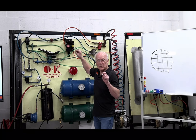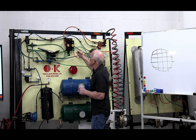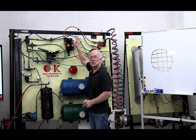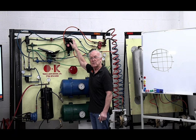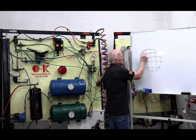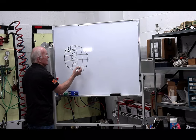And most of you guys would have said 60 PSI. And if you said 60 PSI, you're correct. Because usually below 60 PSI, those of you that work on this stuff, you know you got to do this. You're trying to build up the air. It doesn't want to stay in until you get 60 PSI. So now, what you did was you put 60 PSI over all 30 of these square inches.